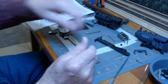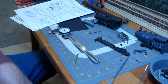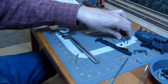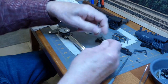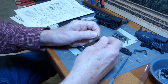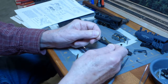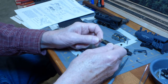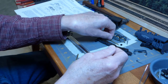I like to paint the under frame before I do assembly of all the side rods and valve gear and so forth, because I hate taking those off again once they're on to do the painting. So this is painted well enough now that I can go ahead with the assembly. The next step is to put the side rods on — those are brass stampings, and like any metal stamping, they have some burrs on the underside. So when I return to the video, we'll clean these up and continue with assembly.